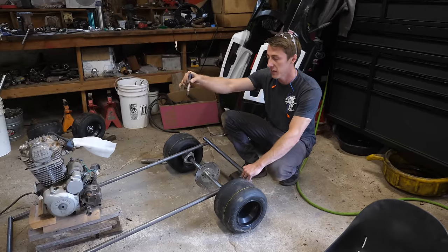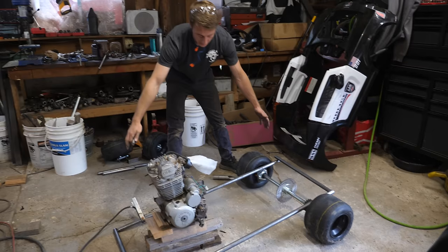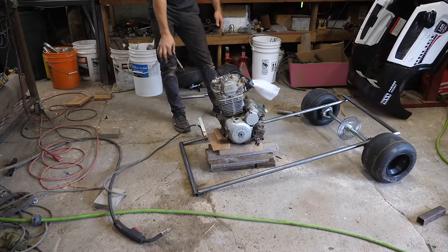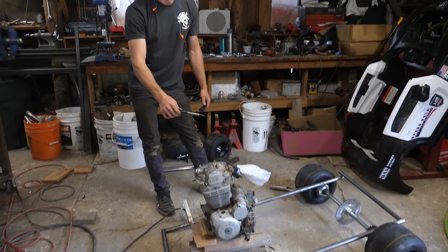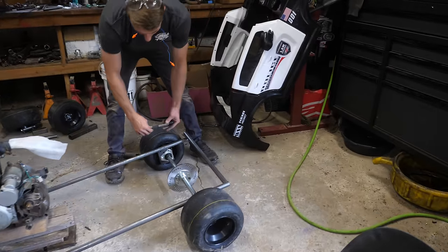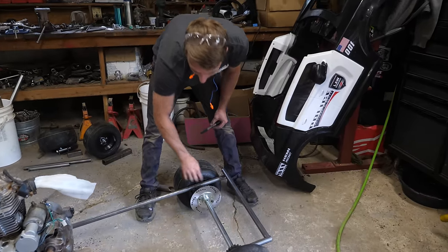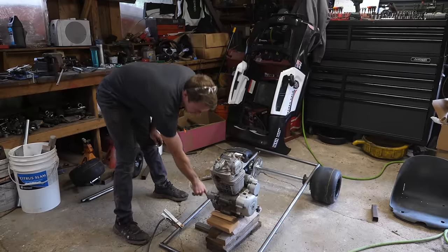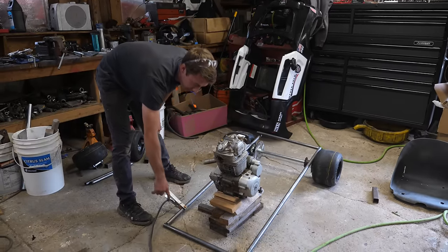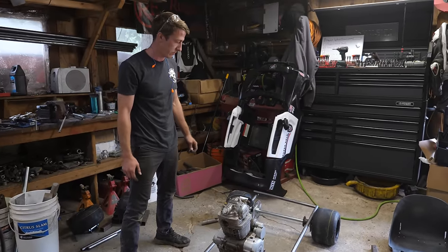So I laid out all the tires and put the body there, got them roughly where I wanted, then I cut this first bar. Now I'm just squaring up a frame to work with. This won't actually be square up front but it will help me with mounting suspension, engine mounts, and all the crossbars. The back will probably stay something like this basic squared corner, and then we'll have some elevated trellis to put the seat on. This will just be really easy to work from — I'll put a crossbar here that will be the actual spindle mount, and basically build absolutely everything before I cut these bars off, so it'll be a really good point to work from with a perfect square.